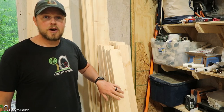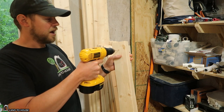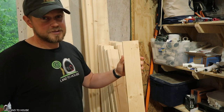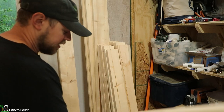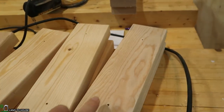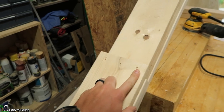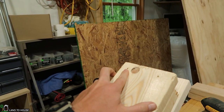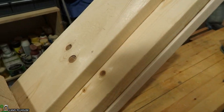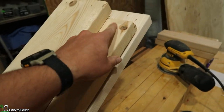Lastly, I'm going to be screwing down all of the slats so they don't come slipping out. On each one I'll come down about 3 inches and put a single pre-drill hole through it, then flip it around and get the other side as well. So to recap: holes are pre-drilled in all slats on both ends, all legs have at least two holes, the front and back have three holes in each end, and the two outer runners have two holes on the ends plus holes along the side, while the middle runner just has the end holes.